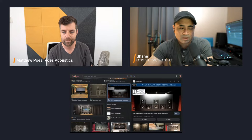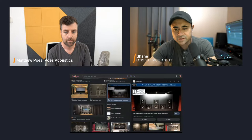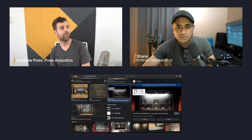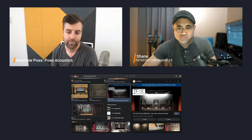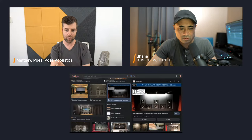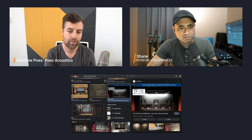The determining factor for depth is going to be the subwoofers. The RBH 1212s are the ported ones — a couple of feet deep, maybe two and a half. Those are pretty deep. One option is to turn them sideways, pointing towards the outer sidewalls instead of towards the viewer, which would reduce the effective depth needed. Otherwise you might need a two-foot-deep false wall, which is doable but starts eating into the room.